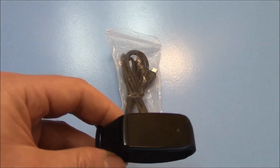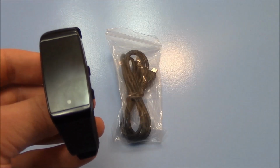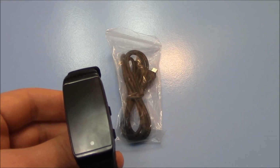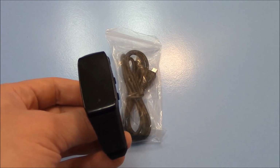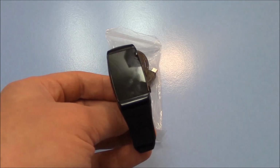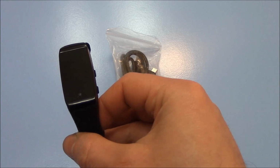And you can also record while the camera is charging. Now to do that, you connect it to the USB port to charge, and you can just press the K1 button, and then the camera will record. But keep in mind that this camera doesn't have a loop mechanism, so when the memory card is full, it will no longer be able to record and will not erase any old recording. Once the memory card is full, it will stop recording and shut down automatically.